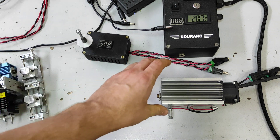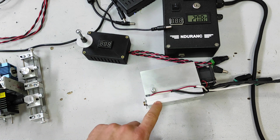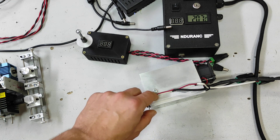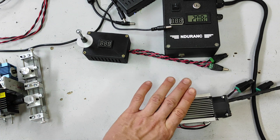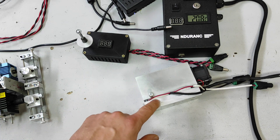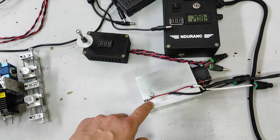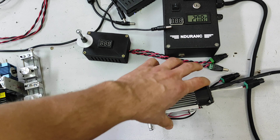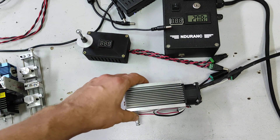So what did we do? We made a 10 Watt Plus Pro laser that has extra cooling. We have an aluminum plate where the laser diode is installed, and we have two TEC plates called Peltier and an external heat sink. The cold part of the Peltier cools down the aluminum heat sink for the laser diode, and the hot side has air removed by a very effective turbine and fan.